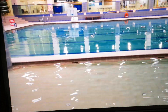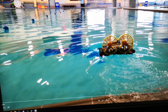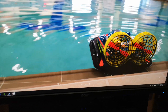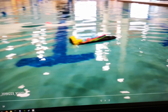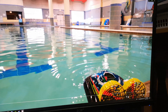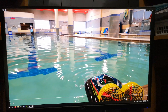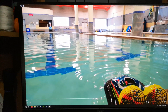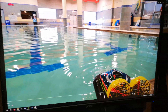Behind the scenes — it nosed down and just died. The electronics are in a waterproof housing so they seem to be fine. I think the battery voltage dropped too low to run all three fans, they deflated, and then it nosed in. I need to set my low voltage alarm much more aggressively. On water I'm only going to get a few minutes of runtime, but the battery had recovered to 12.2 volts when I got back home, so I'll set the alarm around there.